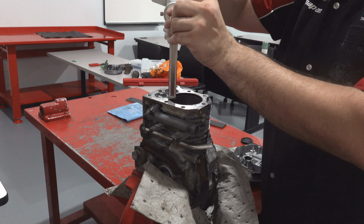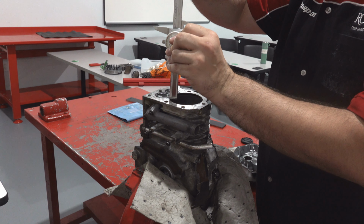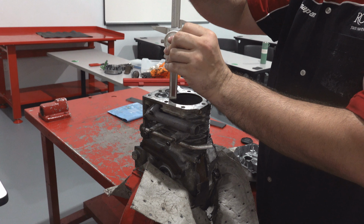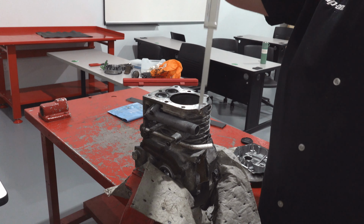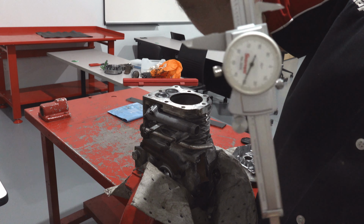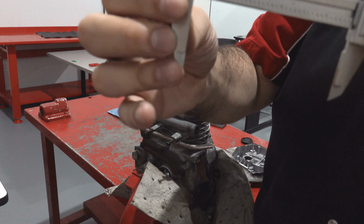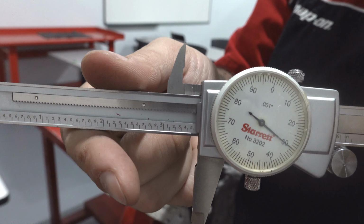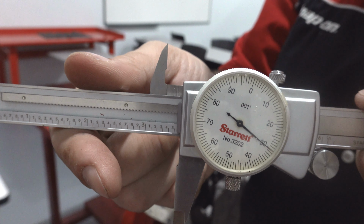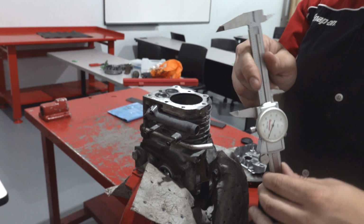It's important to lay the caliper base on a flat surface in order to ensure the most accurate measurement. Once the desired depth has been reached, we read the measurement the exact same way. Let's read the measurement. And it looks like our depth measurement is 3.53 inches. And that's how you use vernier calipers.